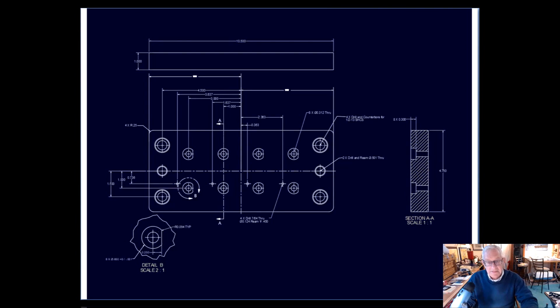Let's take a look at the original drawing I was given. We've got a little section view. The big thing that's got my attention here are these D-shaped holes — not that they're that crazy, but you'll see in a minute why. Notice the way this is dimensioned: we're going from here to here to here, but we really don't know if that's symmetrical. What we have here are four half-thirteen socket head cap screw counterbores and clearance drills — four places, drill and counterbore for half-thirteen socket head.